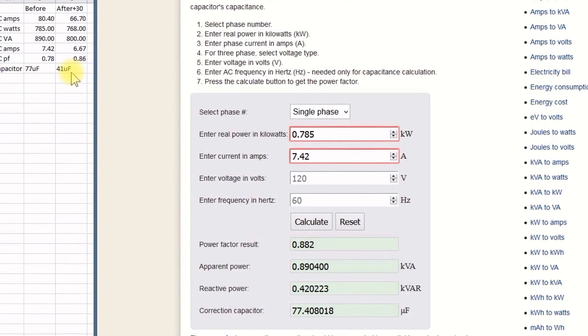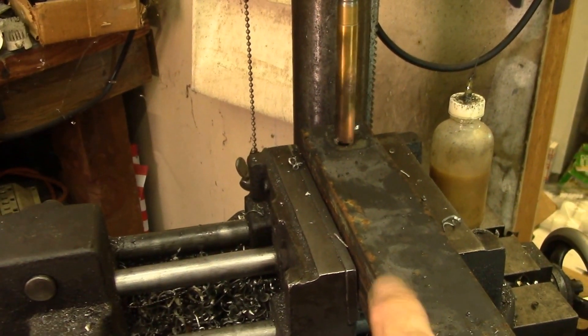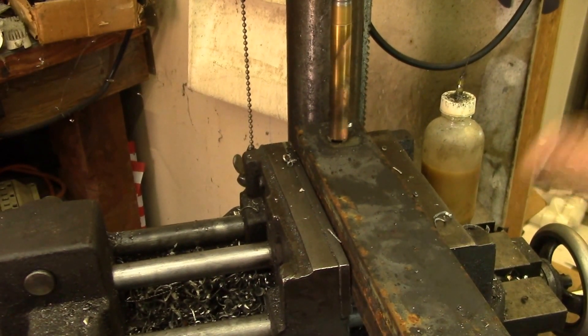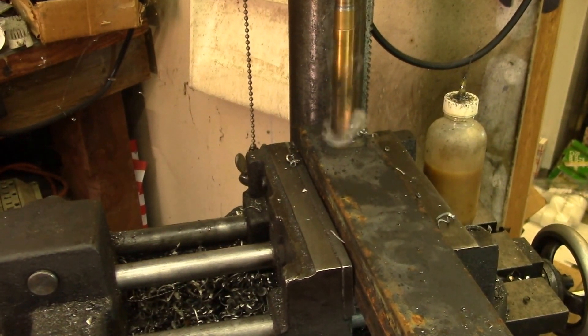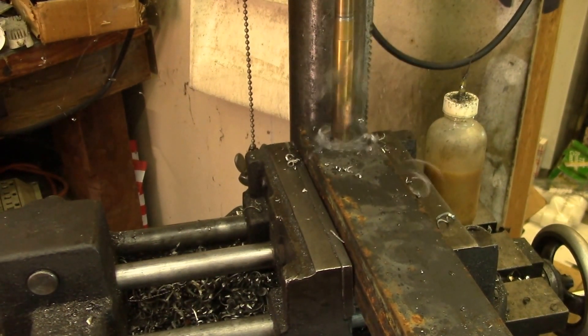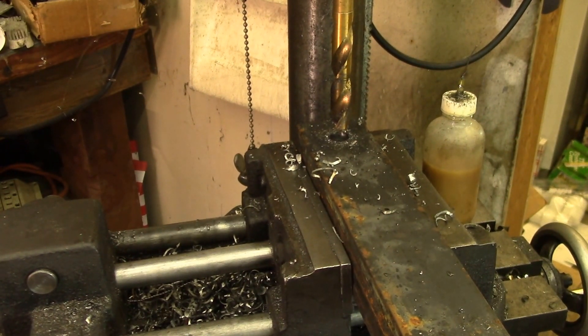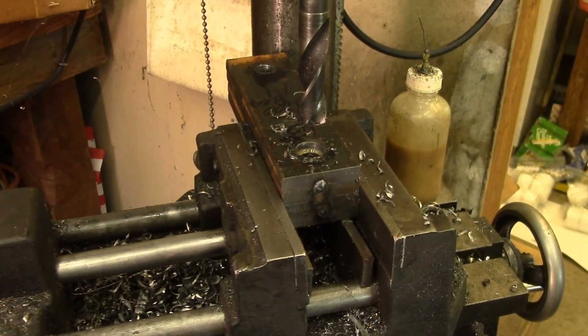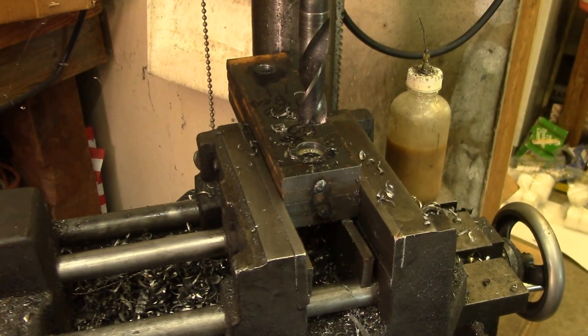Let's go back and look at what I was working on with the drill press. I've got four pieces of three-eighths-inch steel — inch and a half thick — and this is the last of eight 9/16-inch or 14-millimeter holes I'm drilling. It drills pretty good — that's all off of solar power, and it works a little better with that run capacitor. Now this is an 18-millimeter bit, just shy of three-quarter inch, drilling down through the inch and a half of steel.